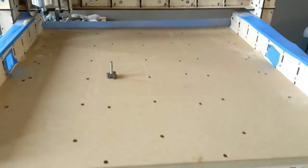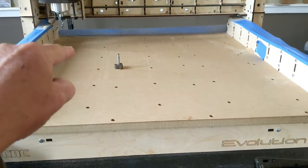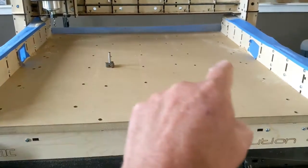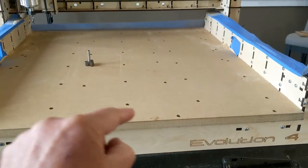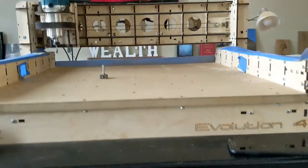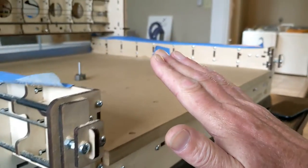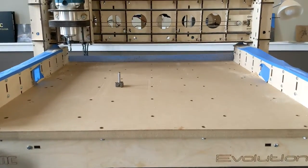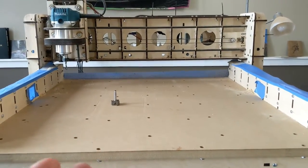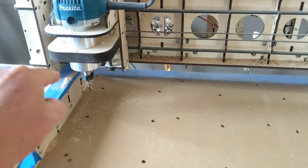I've assembled this machine and what I found is my high point is over there, my lowest point is like right here, about the 18-19 inch area. So basically the bed is drooping like that, and from the side it's leaning forward like that. The deviation is maybe 0.05 of an inch, but we've got to get that cleaned up. The profile I have written is going to start at machine home, so it's going to be X0, Y0.